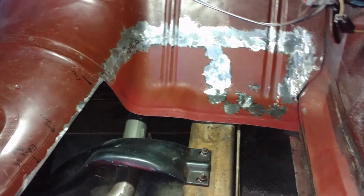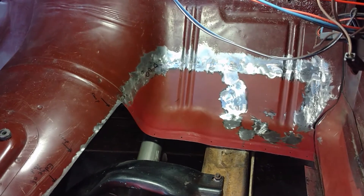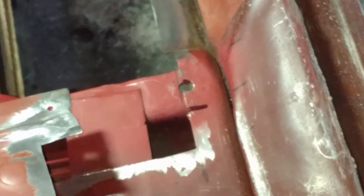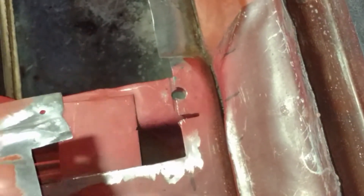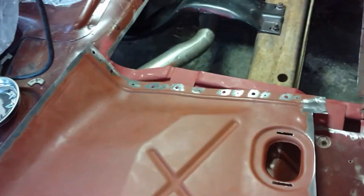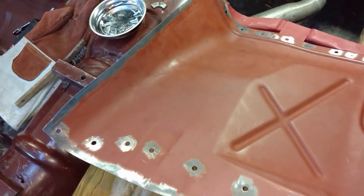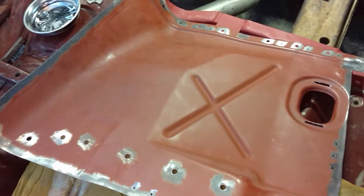Okay, so here's where we're going to start. I've got a couple pinholes up there in the tow board that I need to deal with — quick welding there — and then this little breakthrough spot weld, I'm going to put a little piece of copper tubing on the back and try to weld the portion up that's on the cross member. I'll deal with the piece in the sheet metal when I'm putting in the actual floor pan, and then I'm going to be positioned to get this put in place and get it tacked in. Hopefully that's where we'll end up by the end of the day. I've only had a couple hours to work today being Sunday, so we'll get as far as we can.